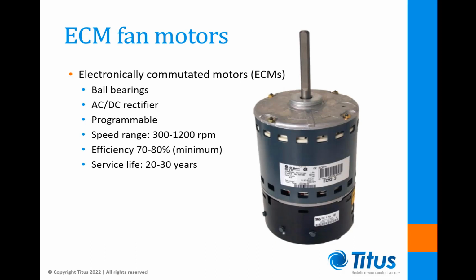ECMs are quickly taking over the industry. These are programmable motors with ball bearings, a speed range of 300 to 1200, a minimum efficiency of 70 to 80%, and a service life in a series fan application of 20 to 30 years. These motors take AC power, internally rectify it to DC, and pulse DC power through an internal digital controller. They use pulse width modulated, or PWM, speed controls.